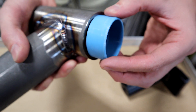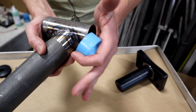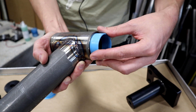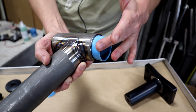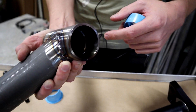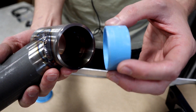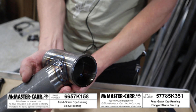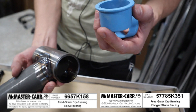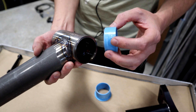If you don't have that step and it's tight before it even gets in, it's really hard to start it straight without a press tool or some parallel-face press. Whenever you're doing a bearing bore, if you have the opportunity it's really cool to do a small step — then you can just tap this in with a hammer gently. So that's a really cool design consideration. Further back in the bore there's another step serving a different purpose: these bearings are off-the-shelf components you can buy from McMaster-Carr. I think this one is $3 and this one is $4 — they're 44 millimeters OD and 40 millimeters ID, a food-grade acetal/Delrin plastic bearing. They'll last forever, but if you ever wanted to replace one, it's just an off-the-shelf component.